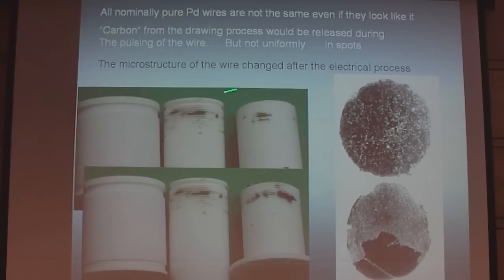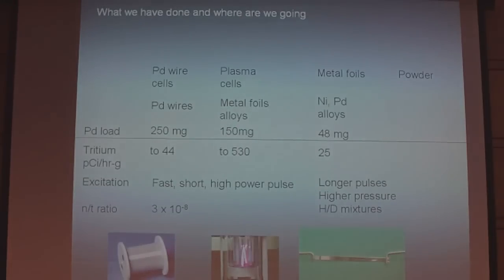The microstructure of the wire also changed during the experiment, so you had sort of a moving target. You started out with this filamentary structure, and then you recrystallized that wire, so as you did the experiment, things would change. These were difficult experiments because the wire would come off the spool, expand, and then break, terminating the experiment. So it was a difficult experiment to do, and that's why we kind of quit. However,